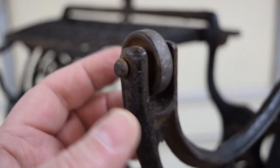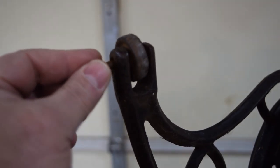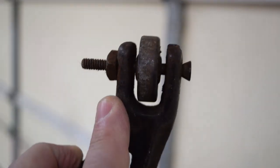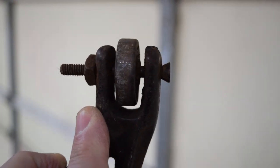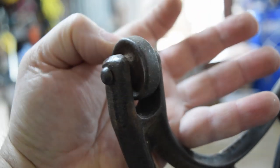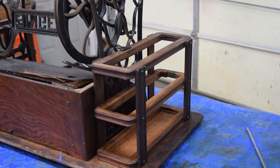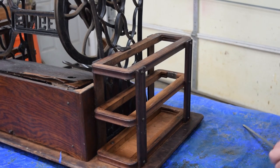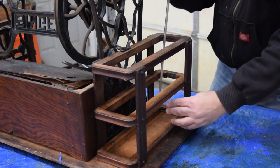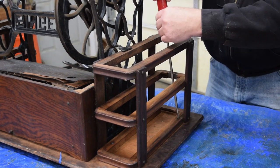And here are the wheels. These are riveted in from the factory, as you can see. We have this wheel with a broken rivet. This wheel here has been reattached with I'm not even sure what kind of a screw or bolt that is, but at least we still have the wheel, and this one has its original rivets. So we're going to have to remount two of those wheels. That's not any big deal. The drawer cases are held on with four screws that go through the top rail of the drawer case and into the tabletop. They're the first things that come off.